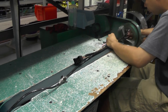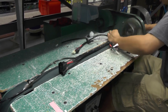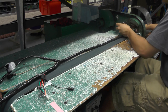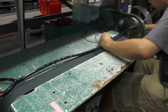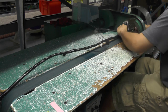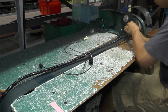Once the operator reaches a wire breakout location, the machine is stopped. The breakout is pulled through, and the taping process resumes. When the operator reaches a harness mounting clip, he slows the machine so that he doesn't tape over the point of the clip.